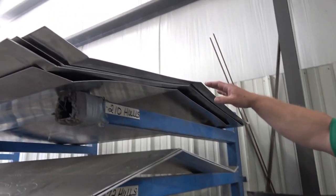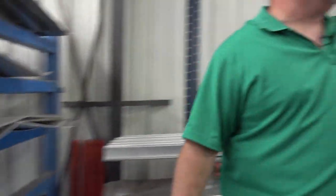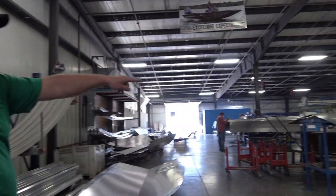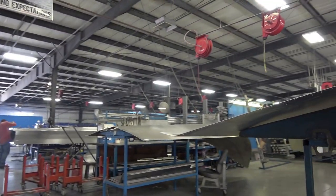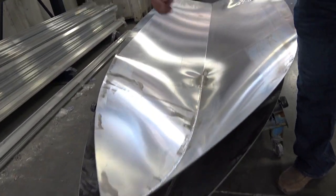The hulls come down in three pieces — we've got side sheets and hulls. This is our centerpiece; they come from fab like this, they're broke, and then we take them over here, put them up on this jig, and they get welded on the bottom side and the top side. You can see it's welded on both sides of that.